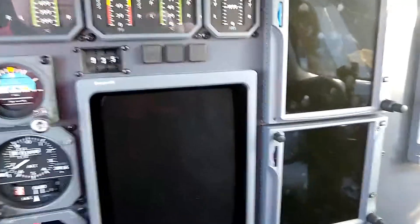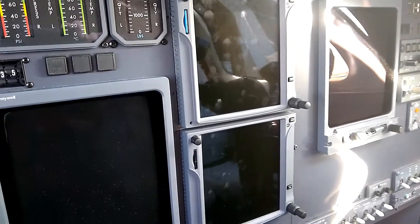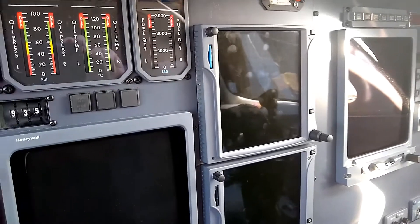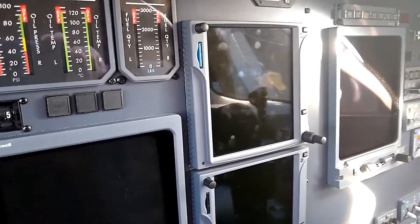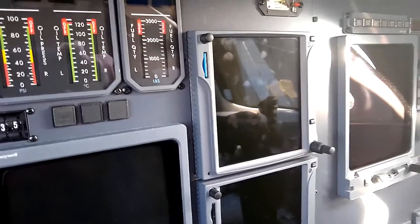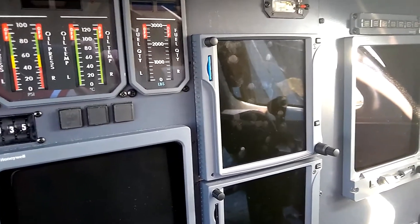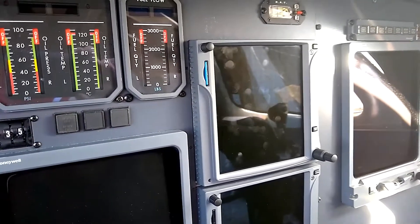This particular aircraft has been upgraded to have dual Garmin GTN 750s for the avionics. On a standard Citation Ultra, you would have NAV1 and COM1 — both the number one NAV and COM radios. The way this aircraft is wired, just the top GTN 750, the number one GTN 750, is what receives power. In the Ultras you also have the audio panels — the GTN 750 has replaced the audio panel — and in a more conventional Ultra you would get power to the overhead speaker.